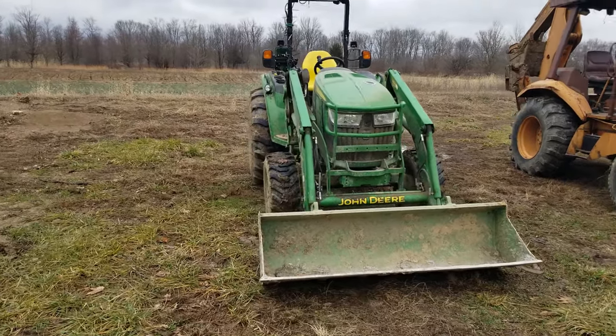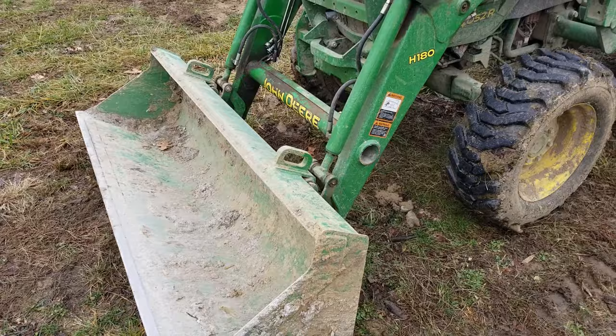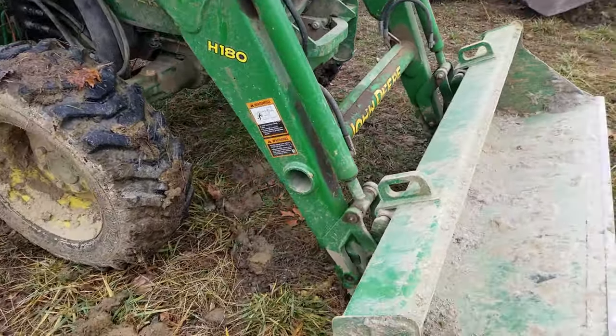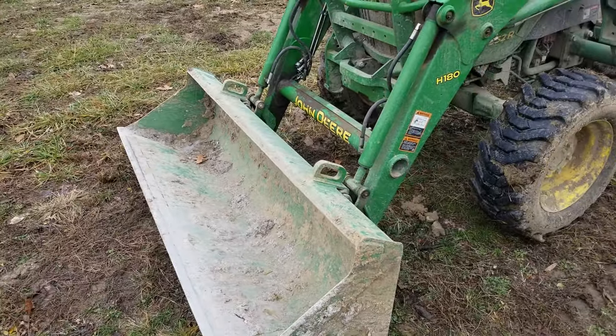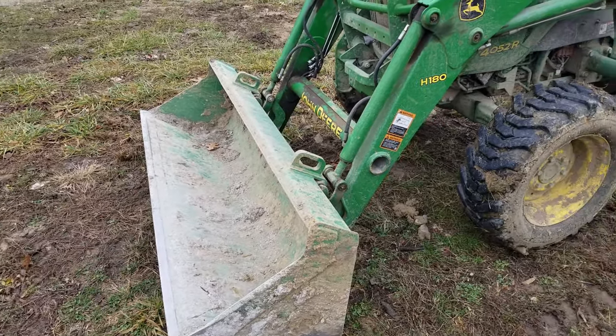We'll jump into the 4052R here first. If you guys follow a number of tractor YouTube channels out there, I'm sure you've seen people talk about not breaking your cylinders when you're back dragging, or preventing damage to your cylinders when back dragging. Let me do a quick recap of what those guys are talking about. As the tractor sits here in the full curl position, you can see that the curl cylinders are completely retracted into themselves - they're not extended and there's no fluid in that cylinder. However, this is not the position that most people have their loader in when they're doing back dragging. More often than not you will want to extend or dump the bucket so that that leading edge out here is doing your back dragging. Let me put the tractor in that position for you.